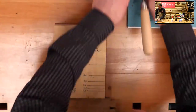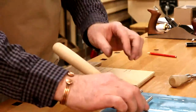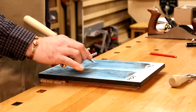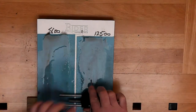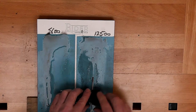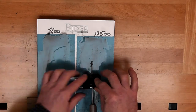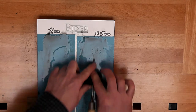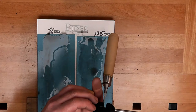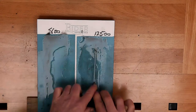Just going to come up to my sharpening board. I'm not going to move the bit. That's good. The other nice thing, I'll bring this back in. With using a honing guide, especially with a small chisel, it makes it more controllable. Now here, I've got to concentrate. I've got a little bit of tilt if I'm not careful that way. I'm naturally right-handed, so tend to be a bit too dominant, so I've brought my fingers in line. That's not too bad. Just want to check it's sitting square in there.